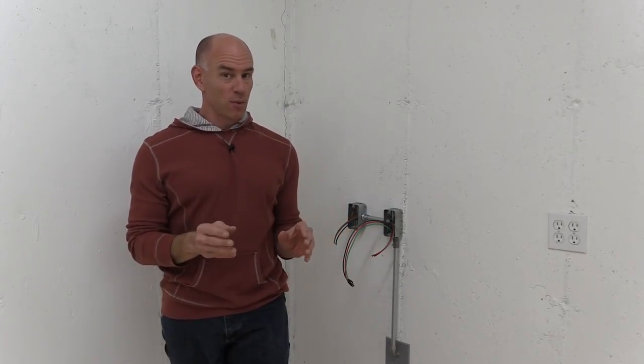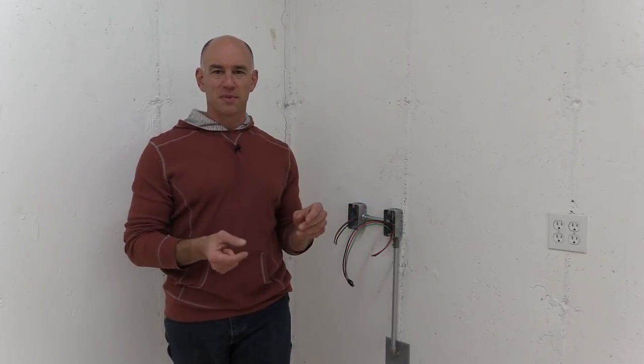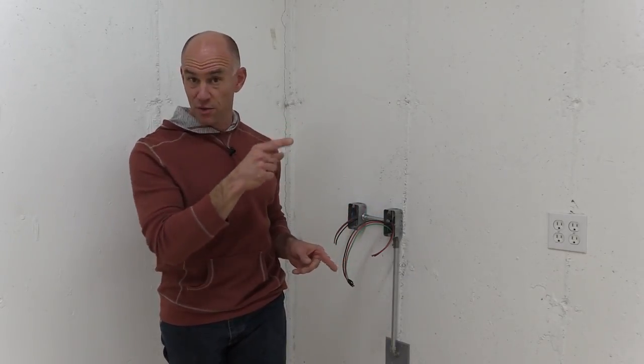So I did some detective work and after that I realized I already had two circuits in here of 240-volt power - 50 amps, no less. I guess the guy before had welders there. Also, if you test the outlets, there are no less than three circuits with outlets, and the lights are on a separate circuit as well. So knowing that, it's just a matter of getting the outlets where I want them, and we'll start with some of the 240 stuff.